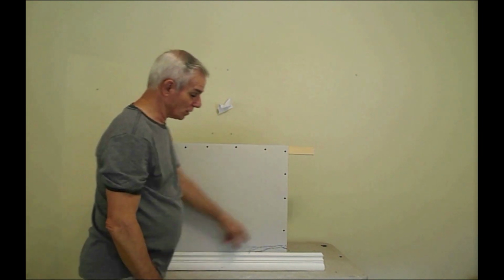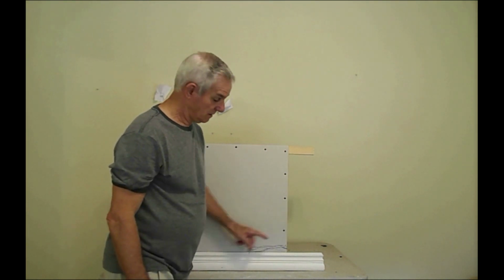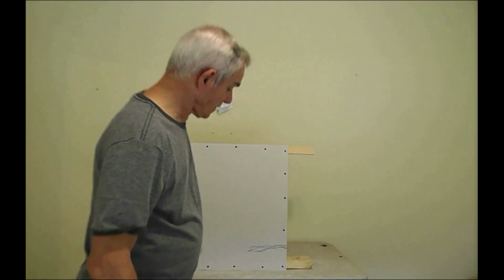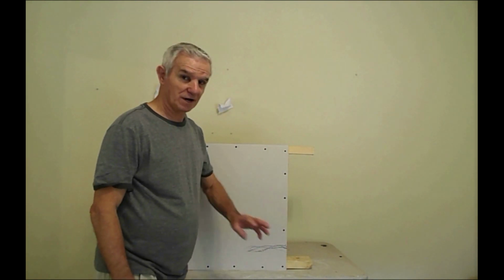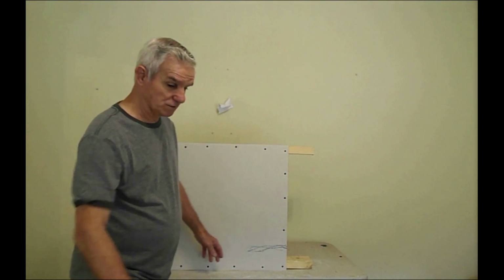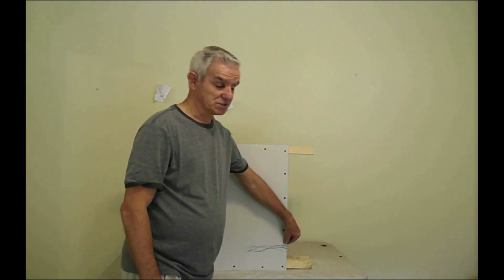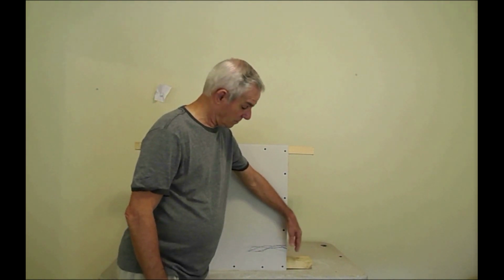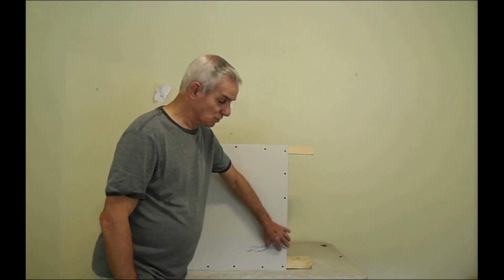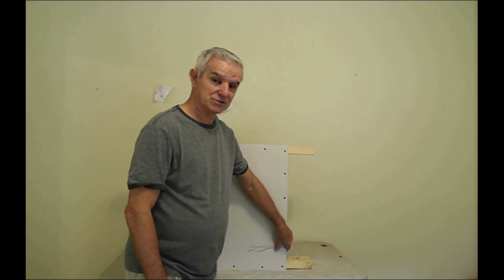So if you have water damage, it just happened and it came up to about here, that's not too bad. You can pull off the baseboard, and you can seal this, but you're going to have to leave it some time. Let it dry. The outside's going to dry really quick because now it's going to get airflow. Remember, inside here is sealed. It's not going to get air. And because it just happened, it's not going to be that bad. It can evaporate some of the water into the rest of the drywall and it will dry out a bit. That you can take care of.